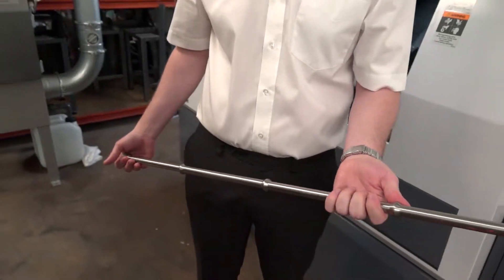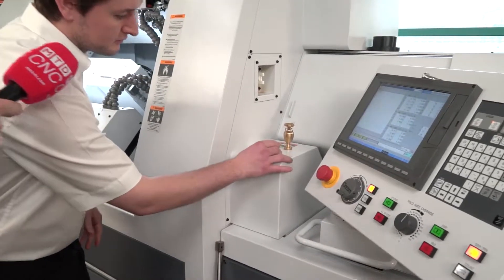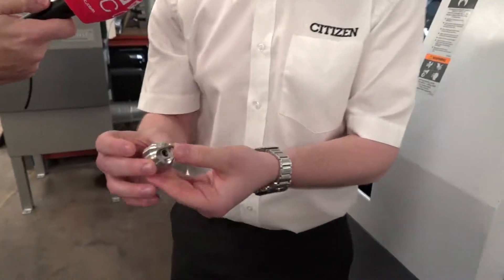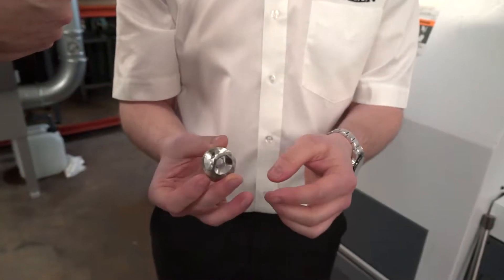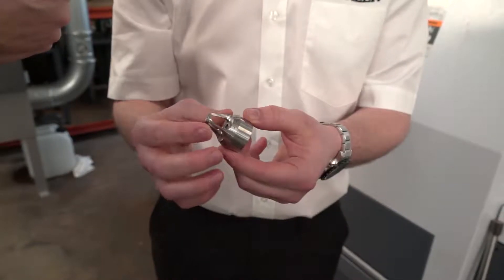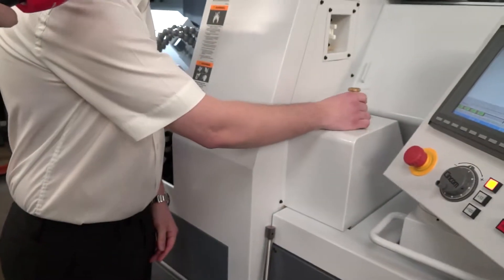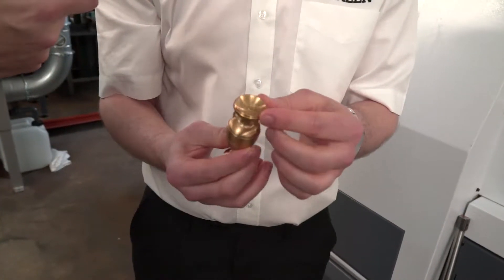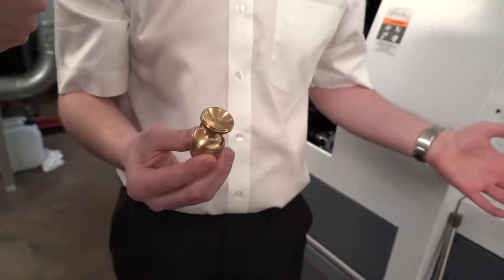Looking at some other components — very, very intricate. What have you done with these parts here? This is milled fully complete on our M32 as well. You might be thinking just long shafts etc., but we do use parts like this on the machine as well. This other component was also done fully complete on the M32, fully milled. So it's not just long parts — small, intricate parts as well, and with this type of machine you're taking away the requirement for a separate milling operation.